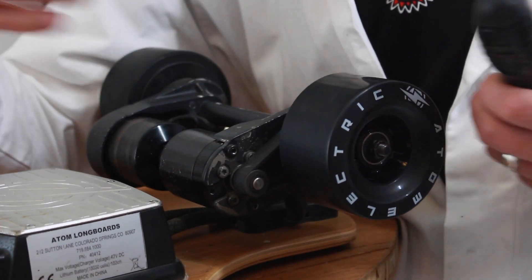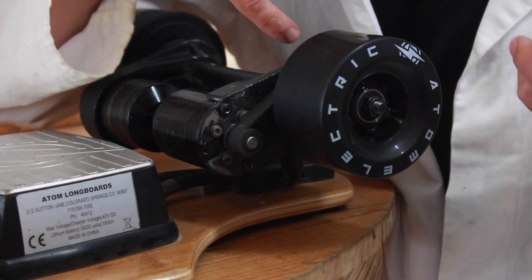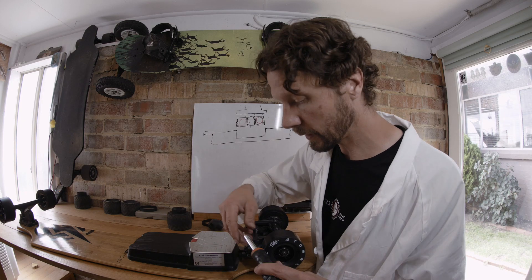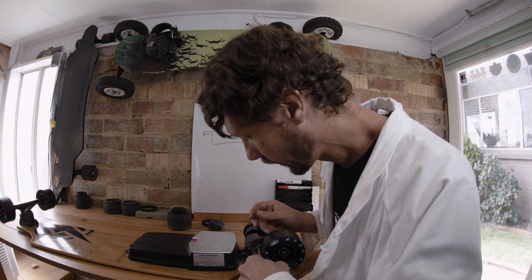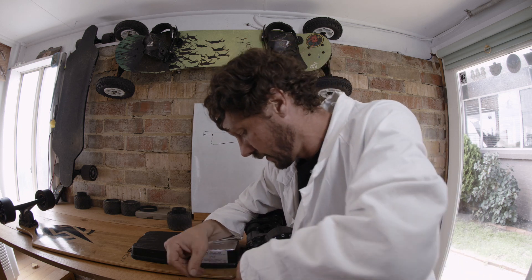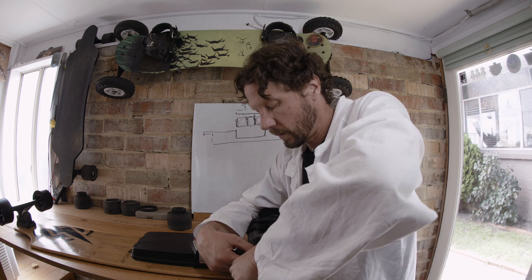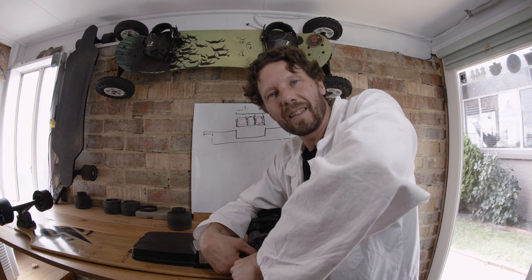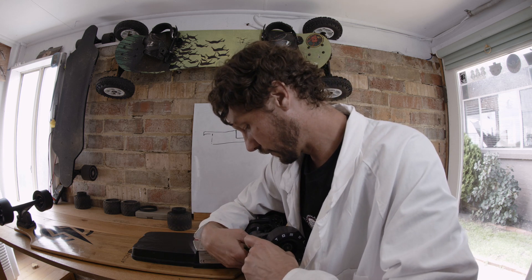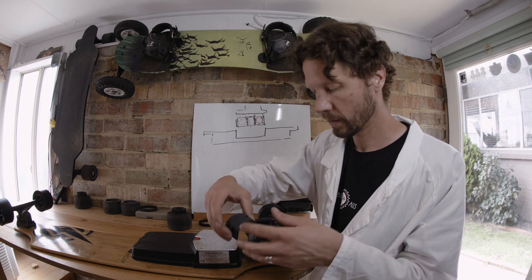It's more scientific than that, but if you don't have the proper tools to measure it, just take a pinky and make sure there's a little bit of flex — not super taut, but not as much as it was before. The true test is going out riding and making sure your belts aren't slipping. Now that you've got those two done, go and get the inner screws tightened up as well. The Torx bits allow you to get those guys pretty darn tight — you're not going to strip it, so just crank away. That just makes sure the motor's not going to slip later. Once you've done all four, go back around again and re-tighten because each one you re-tighten gives you a little bit more room. That's pretty much it — you've got a nice tight belt, not going to slip. Throw your motor cover back on.